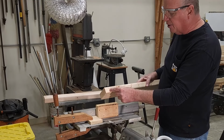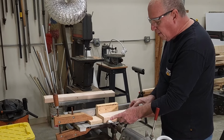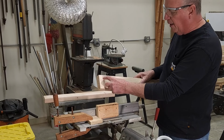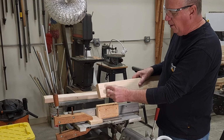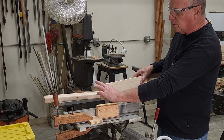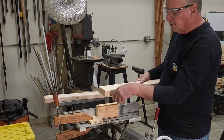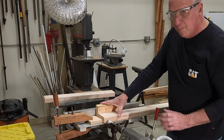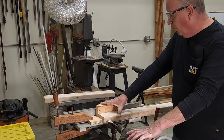I'm going to come down 1¼ inches and down the center, and this is a 3/4 inch bit because I'm putting a dowel down here. You'll see it later, but that will support this because I'm going to drill a hole here where there's going to be a metal ring, and it's going to want to cause this to split, pull open. So having that dowel through there will hold this piece and keep it from splitting. So we're going to bore these four holes.